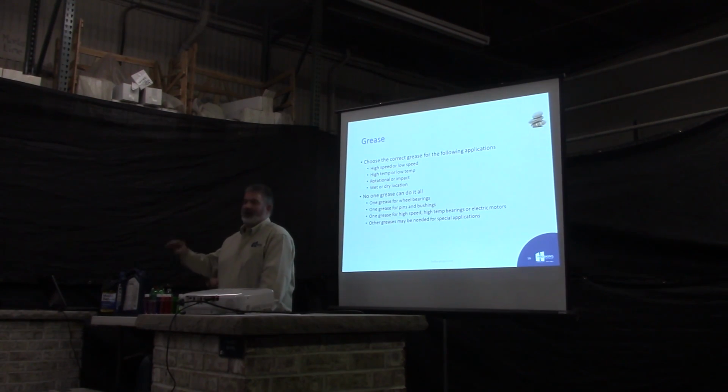As long as you use a quality oil, and let's say you switch over to synthetic, you're not going to do any damage, you're not going to hurt anything. And if you switch back to conventional, you're not going to hurt anything either. We find the synthetic on a lot of our stuff gives us a better wear life, and it seems to work better in the engines. But switching back and forth doesn't make any difference.